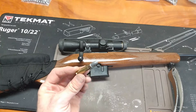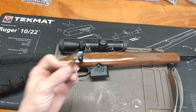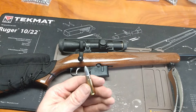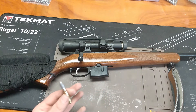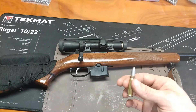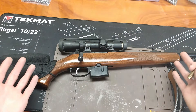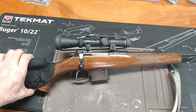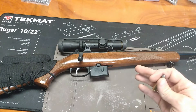Just like in my recent video where I had a shop talk about this cartridge and these CIP spec rifles, one thing I kept emphasizing is we've got to fit our bullets to the throat. And that goes with pretty much any firearm that utilizes a throat. If we're going to run cast bullets, we've got to be mindful of measurements. This is a CIP spec rifle and its dimensions might not be quite as obvious as what we think they're going to be.